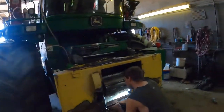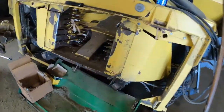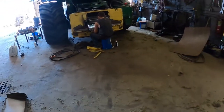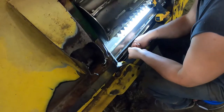We got the processor finally in and the belts on. Now we just got some stuff on the front to do - we have a plate here and one on the other side to protect the front panel from these rollers. The corn head is so heavy it'll dent the front plate, so that gives it a little extra strength. Then there are two plates that get mounted on these holes and come out to guide the corn end better to the rollers. Once those front ones are on we can hitch the corn head up.